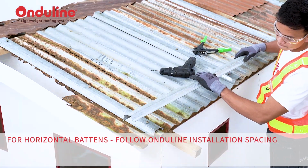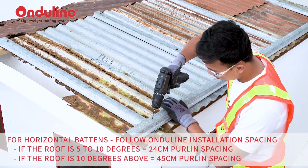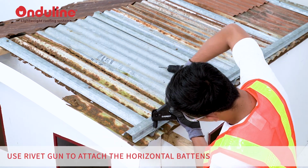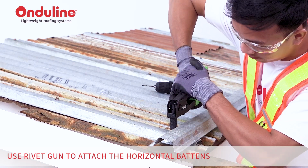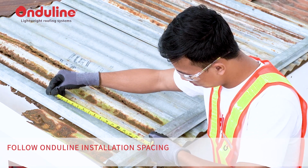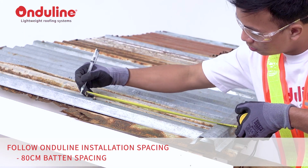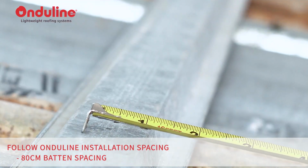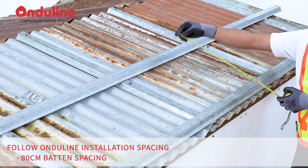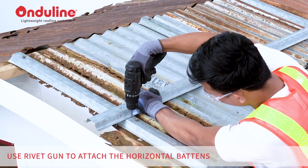For horizontal battens, if the roof is 5 to 10 degrees, 24 centimeter purlin spacing. If the roof is above 10 degrees, 45 centimeter purlin spacing. Use a rivet gun to attach the horizontal battens. Follow Onduline installation spacing.